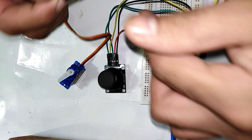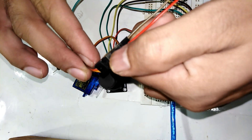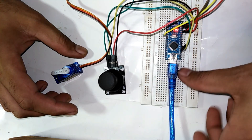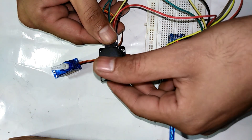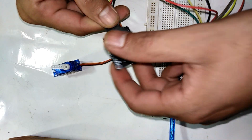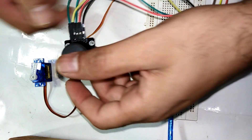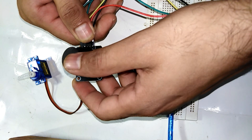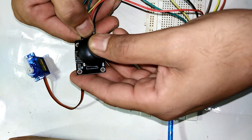Off-camera I took all the connections apart and redid them. There was a broken positive VCC wire and the voltage was not reaching the servo. I made all the connections again and we are back. The servo is at the center initial position — I will rotate it and you can see it's moving left, right, left, right. It's working very nicely.